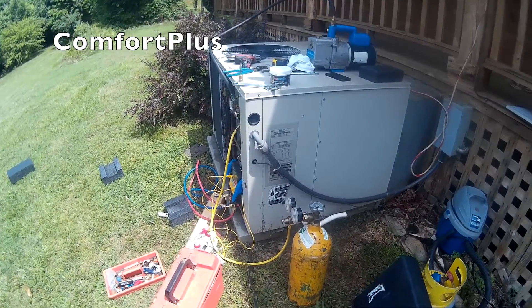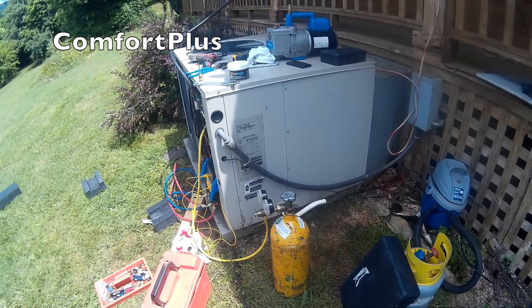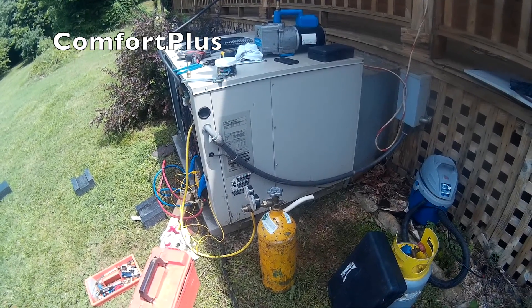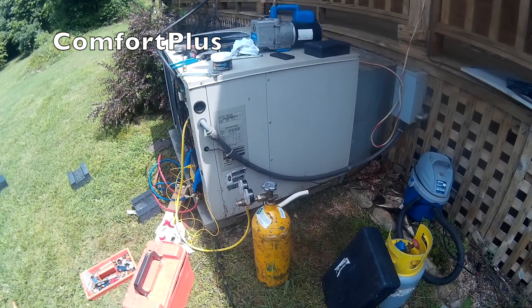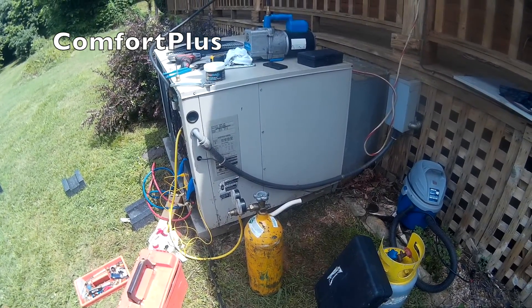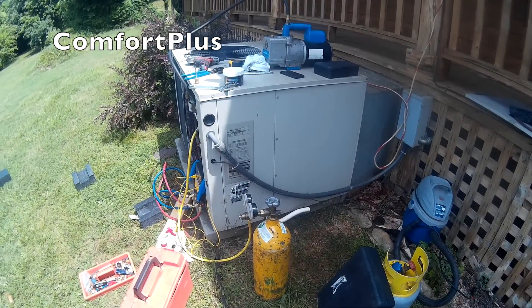She's almost back together again. I broke the vacuum three times with nitrogen to try to clean it up some. I'm getting ready to pick up the rest of this and stick the micron gauge on her. She's been running for about ten minutes since I broke it with nitrogen last time, so I'd say it's getting down there pretty good.